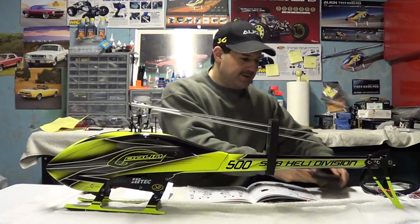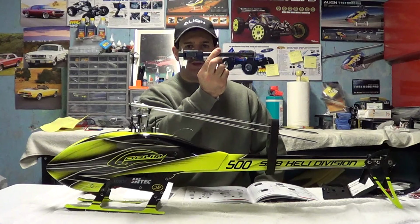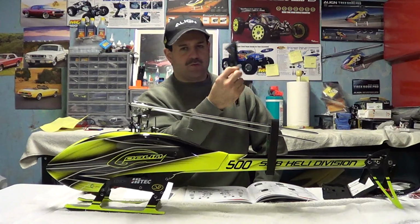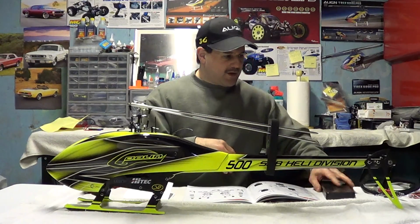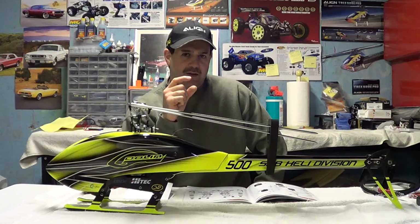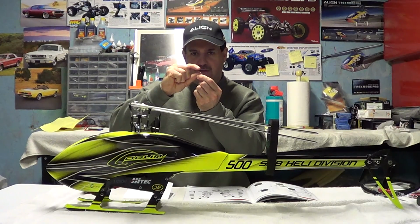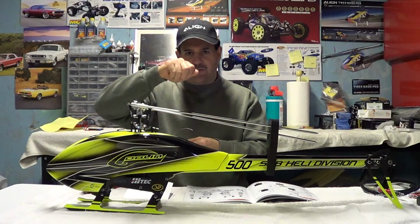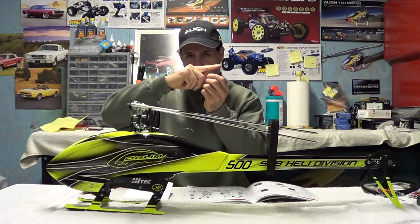That's when one of these guys comes in. Alright, you need to get yourself one of these digital calipers here, and you can use this either in digital mode, or you can read the little graph on there, the old school type way. And you need one of these to measure that, okay? Now what I did was, instead of measuring it, I just put the sleeve on. And once the sleeve was at the base of the motor, then I measured from the top of the sleeve to the tip of the shaft. Locked down my caliper, got that measurement, took the sleeve off, put that back there from the tip down, then I put a piece of yellow tape around it so I would know exactly where to cut it.